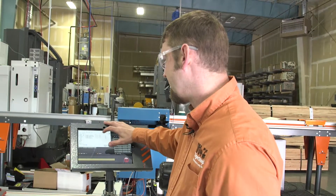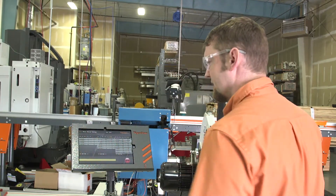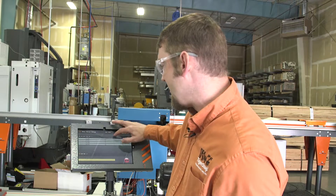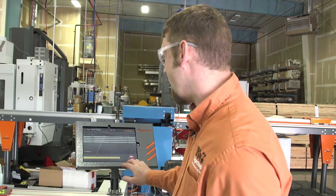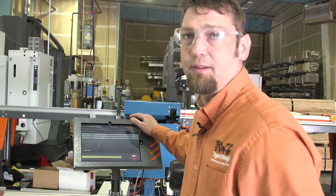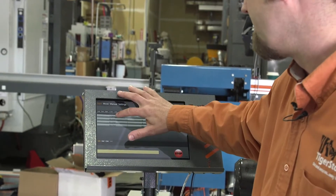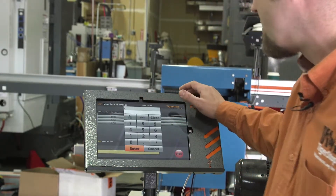We're going to load our list and run that same one. I'm going to swap it again and move it over to the left, then open it up to where it takes up the whole screen. Now this was a list that took a while to run and now I want to edit the list. You can actually pick on any cell on the screen and edit it. So instead of cutting two parts, I want to cut one — and it changes it to one. I can pick a different cell and say minus line, and what that does is pulls that part out. I can also add in a line, which adds in a part that we can then edit however we want for the cut list. I'm going to edit this down to where we don't have as many parts to run on this list.